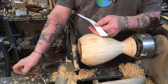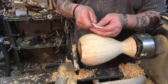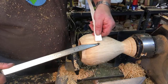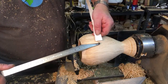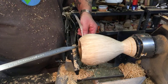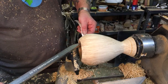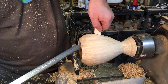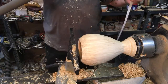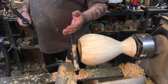And what you do is, you fasten this on to the jig, so you've actually got the space of the wall thickness you want, and then it needs to be a fair way out. But as it's turning, the plastic will bend down until you get to the thickness you want, and then it'll come up and sit straight. And that shows you when you actually have the proper thickness, if that made any sense.